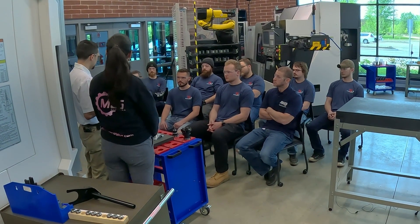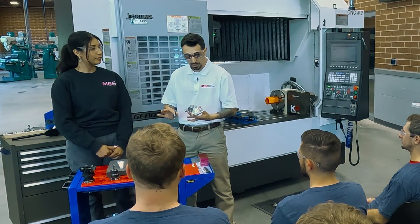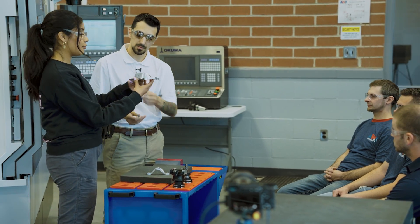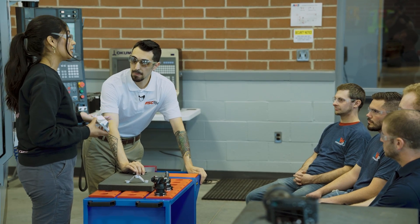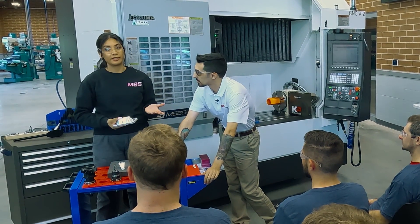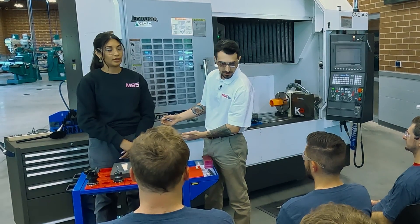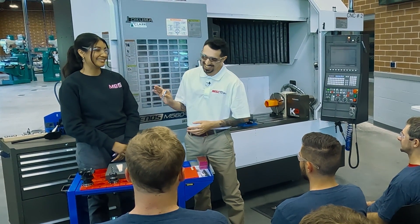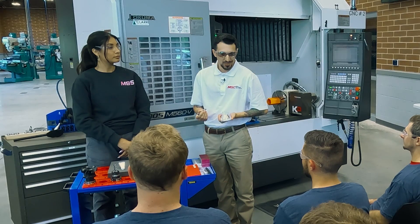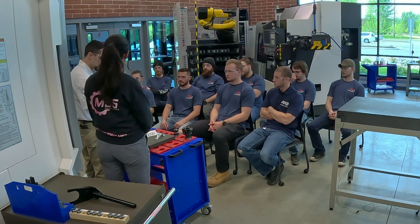The cool thing with selecting your tool for roughing is you're removing as much material as possible. Once you do that, you move on to picking a tool for finishing — where you just come by and take off the remainder, about 10 to 20 thou. I really don't like to leave more than 15 thou. And she just said: don't use the same tool for roughing and finishing. What's the point of running an end mill as hard as you can to rough out material and then ruining a beautiful part with that same worn tool?